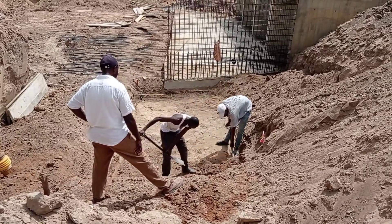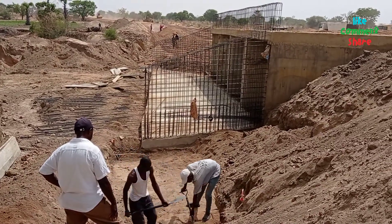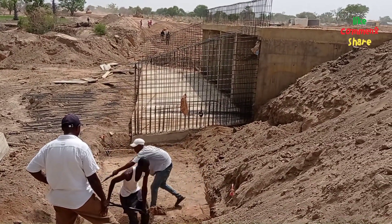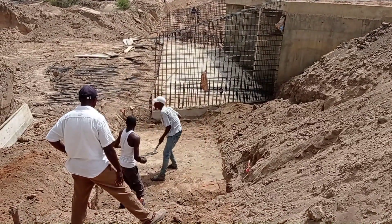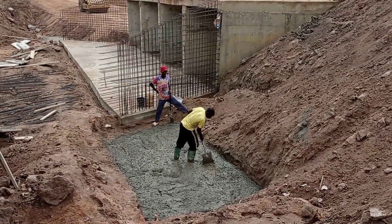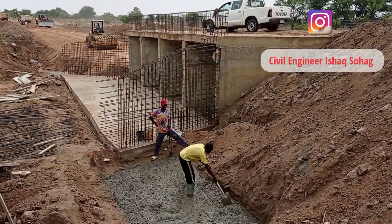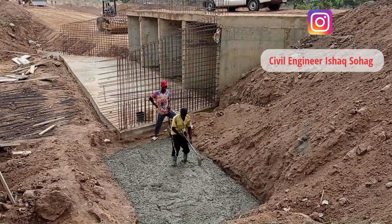You may see here that after the excavation — we are carrying out the excavation manually — so that we may construct our retaining wall. We had to do this minor excavation so that we may have a proper level to pour concrete. You may see here that we have poured concrete; this is the concrete blinding we have to do.